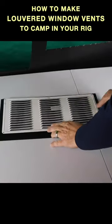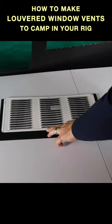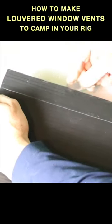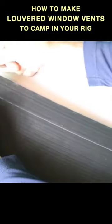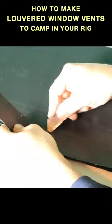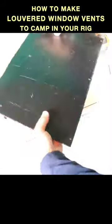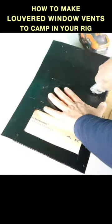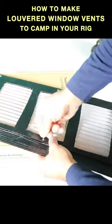Then test fit that the louvered panel is aligned along the top edge and centered. The lower two inches of the back side of the corrugated panel is now to be removed such that you only have the front face of the lower two inches attached. To maintain rigidity of the panel, I chose to make three separate holes for the vent and secured the vent to the panel with small bolts.